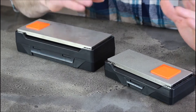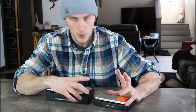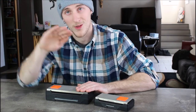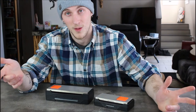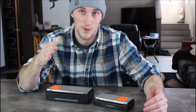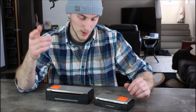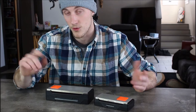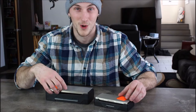They sent me two sizes of stones: the smaller one is the 156N and the larger one is the 162N. Both products can be found on Amazon and I will put links in the description below. What I find particularly cool about these sharpening stones is that they will not wear down. If you look at my regular white stone, it's got a big belly in the middle — which is a detriment to sharpening. It's hard to get a consistent bevel across your knife if you have a big divot in the center of your stone, and it's almost unavoidable if you deal with carbon steel like I do. Another thing I like is that these don't require any water or oil to use — you can use them exactly as is, which is really cool and really convenient.